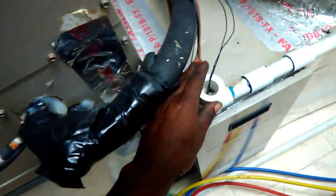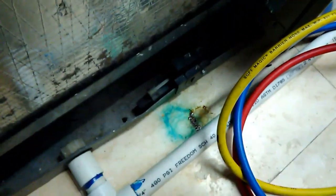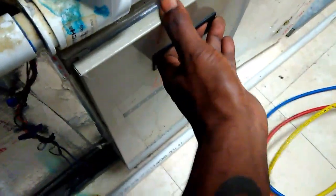The blower motor is running, the evaporator coil is clean, the filter could use a change. The system has an air purification system on it — an indoor air quality product. We've already checked the drain line; there's no standing water, so a blocked drain definitely isn't a problem. We've also checked the secondary flow switch in the auxiliary pan, and that seems fine. The customer has a five-inch filter — it could use a change but it's not too bad. The unit isn't icing up, it's just not cooling. It appears the condensing unit is not running, so we'll head out there and see why.